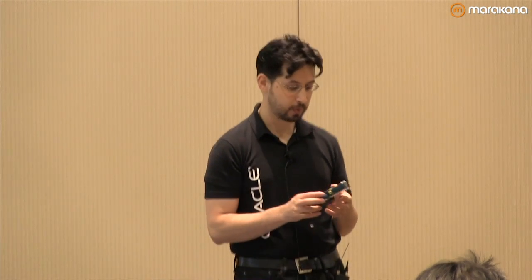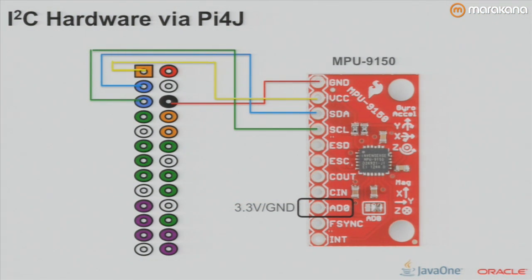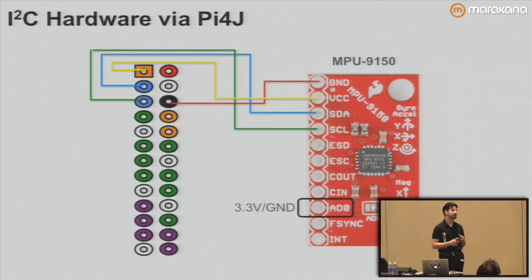You can do lots of cool stuff with the GPIO pins. This is an example of an accelerometer module, the MPU 9150. You can hook this up and get motion detection on your Raspberry Pi just like you would from a cell phone. You're not going to get a clean API like a mobile phone but you'll get nice low level numbers you can interpolate. Any device which supports I2C or a couple other interfaces you can use via the Pi4J library. Pi4J is an open source library that works with the Java SE embedded release and lets you take advantage of the GPIO pins. Eventually they'll roll some of this support into the official Java release, but for now open source libraries are your best option.